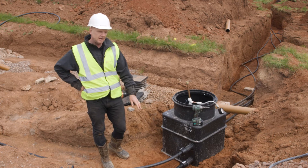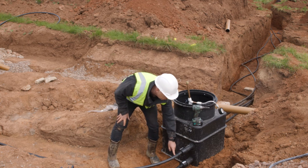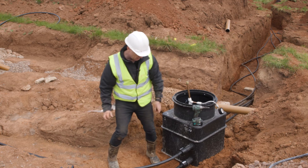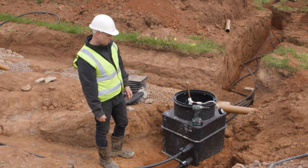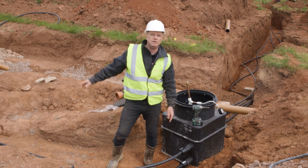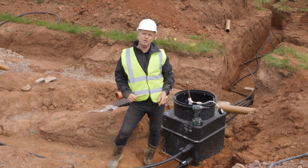We've connected those last connections on the manifold and cooked those fittings. We're going to leave those now — it's really important to remember not to move any of that pipework so we don't break that weld. I can already see that the nodules on each end have both pushed upwards, which is a good sign — it means they've been cooked and they're extremely hot. Also important: we need to let the plumber know which pipe is going to be the flow, because when it goes back into the plant room he needs to make sure he gets the right connection at the heat pump end.